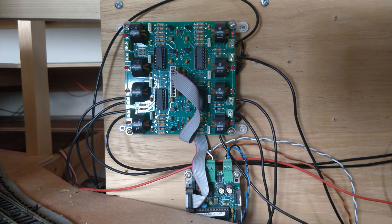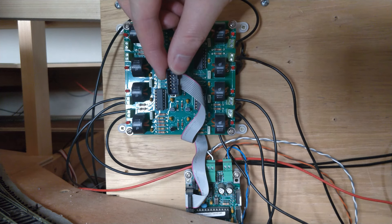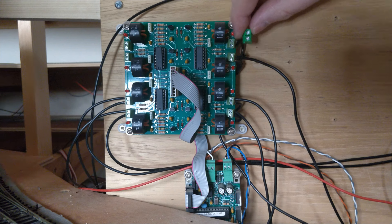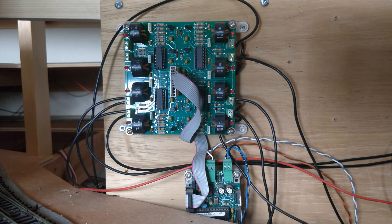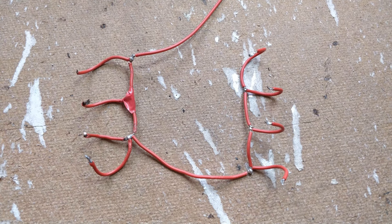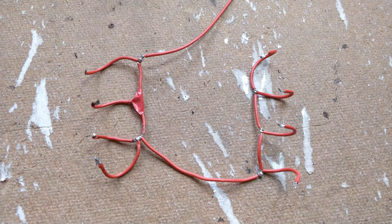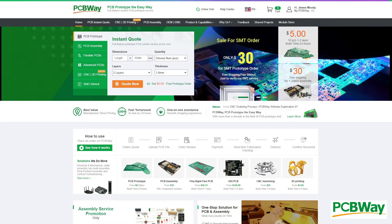Making these cables up to connect from the servo board to the train detector is honestly a bit of a pain. If the train detector board had the same 10-pin socket on it that the servo board does, we could just connect one straight to the other with an off-the-shelf 10-wire cable. We could do with bigger screw terminals too. The club layout is being built with the standard that all wires have crimped ends, and the terminals on the MERG kit are too small for our standard block wire with the end crimped into a ferrule. Having some form of power distribution internal to the board would also be useful. Making up an eight-legged spider cable to feed the board's inputs is another annoying task. If the input side of the train detector could optionally be common together, that would eliminate a lot of this wiring. These are all relatively straightforward changes to make.